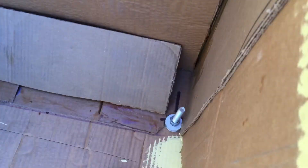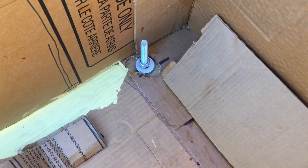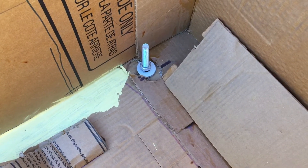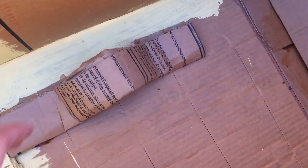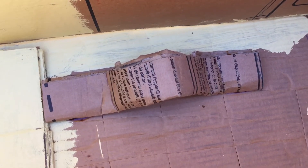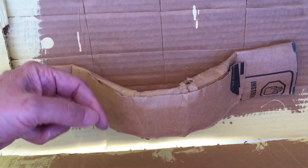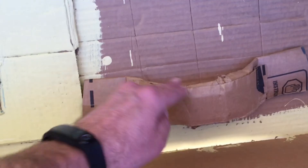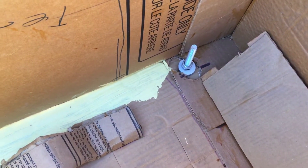Here's the inside. We used eye bolts to connect it — eye bolts in the rear. This is kind of our seat pad for a nice seat. The eye bolt was about six inches long, three-eighths — good solid materials so they wouldn't come apart. These two handles are for the driver to grip and hold. If you couldn't use an eye bolt, here's how I would fasten the axle to the bottom: fold over a bunch of layers — just a whole bunch of folded cardboard wrapped around four or five times with lots of glue. You can make something in the shape of an eye bolt and run your axle through there.